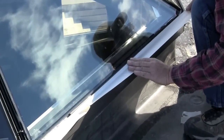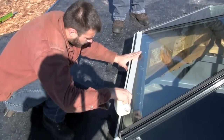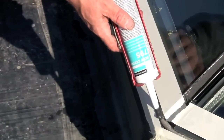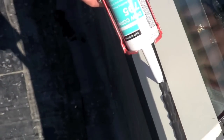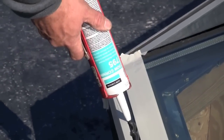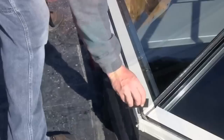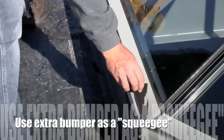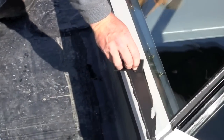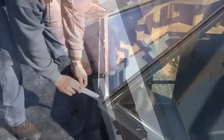Apply a two inch wide tape to the glass surface approximately one quarter inch up from the bottom edge and then to the top of the surface of the glazing support sill. Apply a bead of Dow 795 silicone sealant, supplied in the hardware kit, to the area where the backer rod was installed, making sure to cover this area well. Use one of the extra quarter inch bumpers from the hardware kit to squeegee the silicone sealant smooth, forcing excess sealant onto the tape surface. Remove the tape and discard.